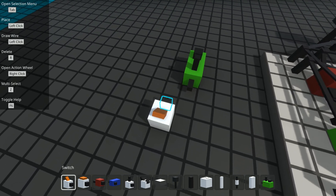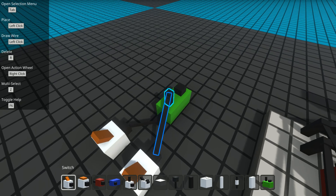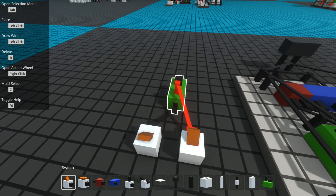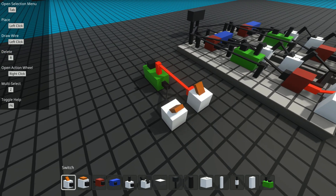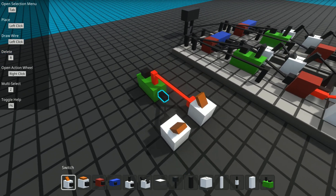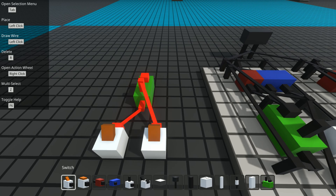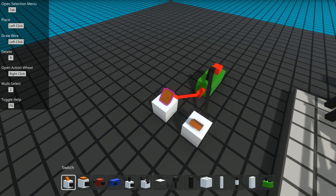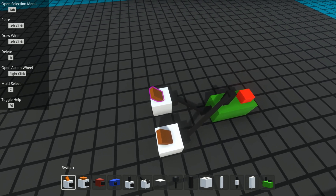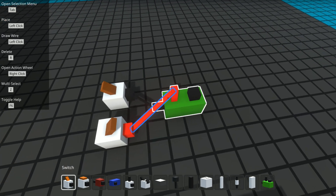I'll have two switches: one switch goes to the data line and one goes to the enable. The enable is the one on top, the data line is on the bottom. When the enable is set high, when I hit the switch it will latch that value — it'll become one. To show it's latched, I'll turn off enable and then turn off the data line. It'll go to zero but keep that latched value. If I flip enable when the value is zero, it'll latch a zero.